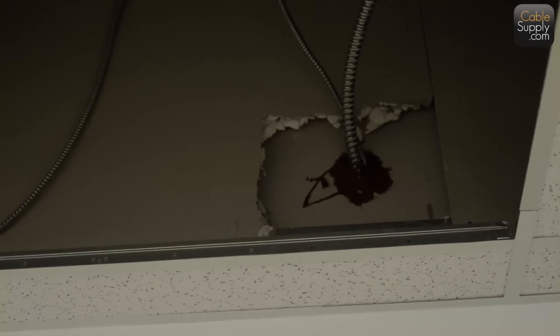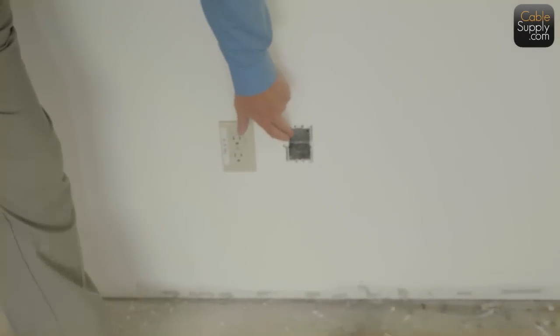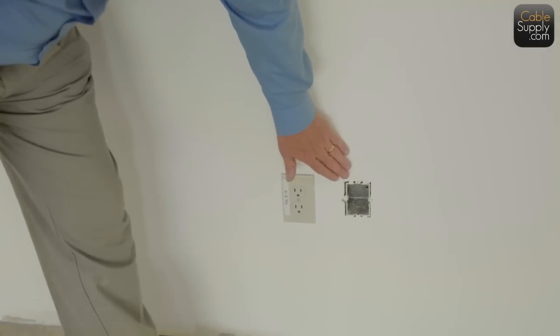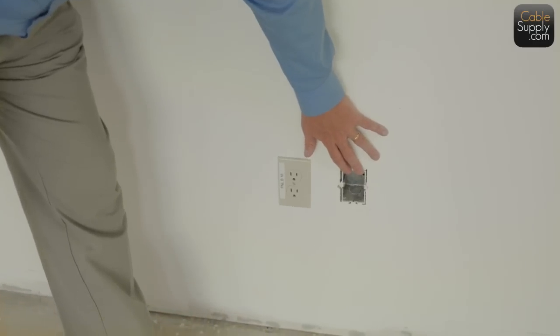Hold up. See, up here is a firewall, and you can see it. There's fire caulk there. So if there's a fire in one suite, it's going to have a hard time getting to the other side. But if you look down here, follow me down to here. You see, we have metal boxes on this. That's because this is a firewall. You've got to have metal boxes on this. And this is a low voltage metal box. It's used for the low voltage side.